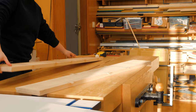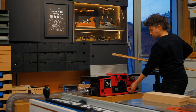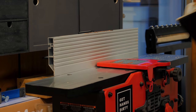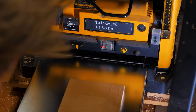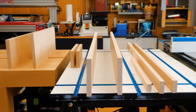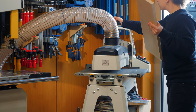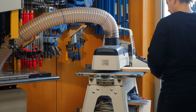They came out a lot better. Now I can remove the shims, scrape off the hot glue, and clean one face of each smaller board. When running the opposite faces through the planer, I noticed that one of the boards was always getting tear-out. So I kept that board about 1mm thicker than the others and used the drum sander to complete the job, running multiple passes and lowering the rollers a tiny bit on each pass.